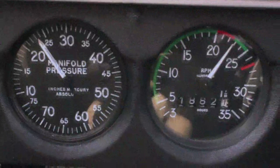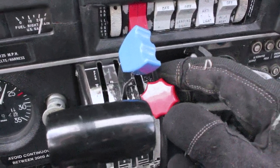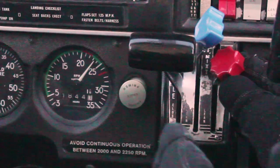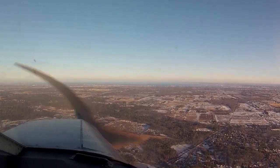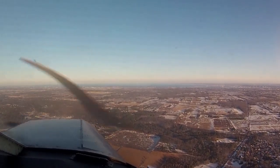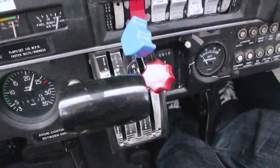Failing that, you're going to feel it start to get rough — what Dennis calls 'rolly' — meaning the engine goes as it becomes unhappy. You can feel it getting a little bit rolly, so then you advance the mixture a little bit. You can hear the engine surge; the prop will change pitch to compensate for the sudden lack and then resurgence of power. Basically, that's about as efficiently as you can lean without having other equipment like an EGT gauge or a fuel flow gauge. Adding to the challenge is that this airplane uses a lever-type mixture control, which is harder to be precise with.